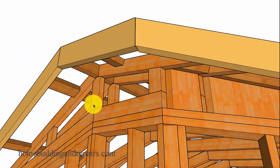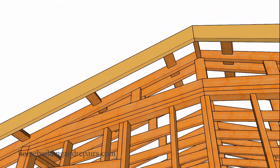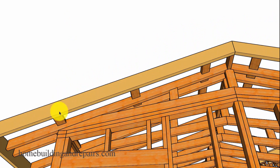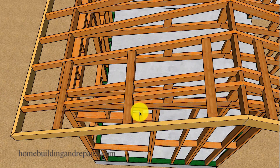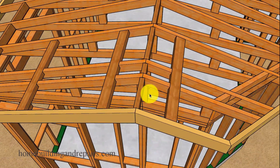You might have a few more studs in here, or support studs spaced 16 inches on center if necessary. The top pitch on the roof is a 4-12, and the bottom is a 2-12 in our example. This rake wall here and this rake wall here can be framed at a 2-12 pitch. And of course our lookouts here to add support.